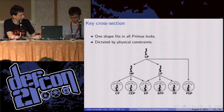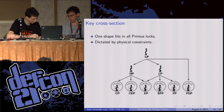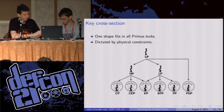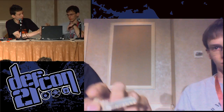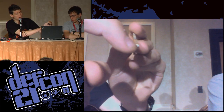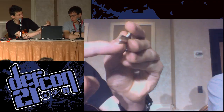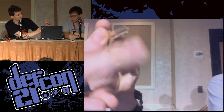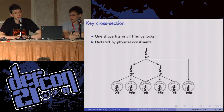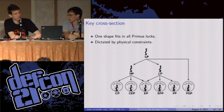key, in that the key has got to have this, I'll show you, where's the real one? This one? Yeah. There's got to be a big hole in the side of the key so that the finger pins can ride on those grooves. There's got to be a sidebar. There's got to be material here for the side cuts. There's very little flexibility to remove additional material around the sidebar. So in that respect, the sidebar is actually making it less secure than a regular lock, where there could be a very complicated warding blocking a key.